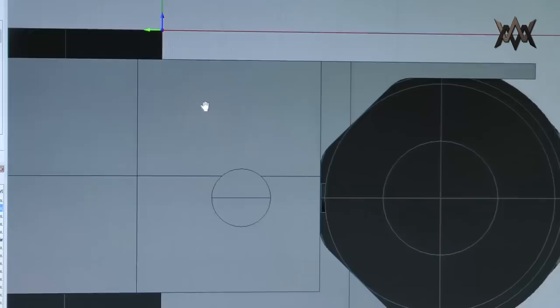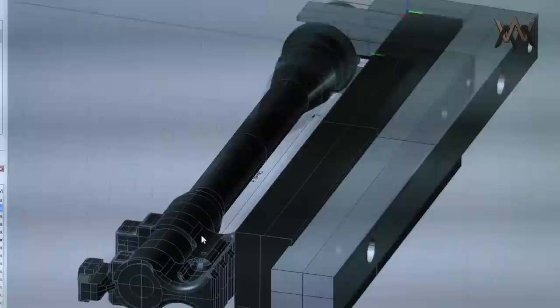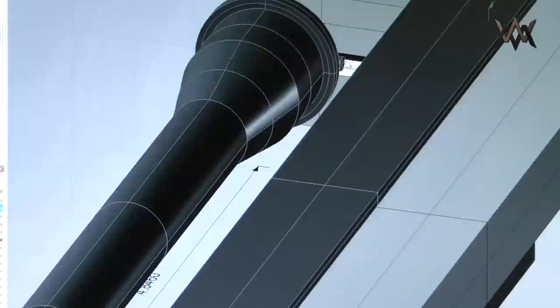Now, if you look around the other side, you'll see the barrel has what's called an indexing pin at the top, which is basically just a 1/8-inch dowel pin, and it is perfectly lined up with the gas port on the barrel, because they're done in the same operations at the factory. So what we can do is drop that indexing pin into this 45-degree V-block sort of thing, and then it will now index it rotationally to be perfectly 90 degrees off from your Z.